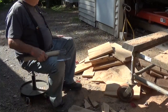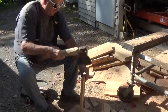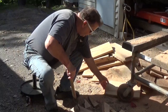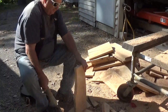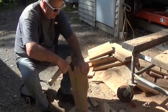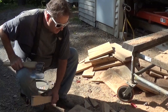It's nice when they all split like that, but they don't all split like that. Here's one with some pretty straight grain in it, so this shouldn't split too bad. But I've got one here that has a curved grain — the grain comes down and curves out. So when I split it, it doesn't want to split all the way down; it splits down to the grain and then stops. Over here you can see it goes all the way to the bottom. So I can't really split that with a hatchet too easily.